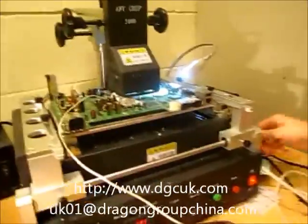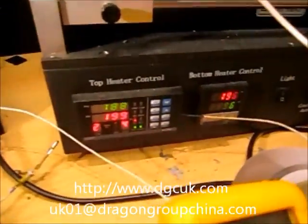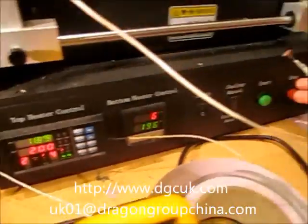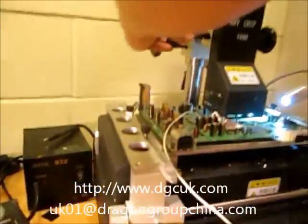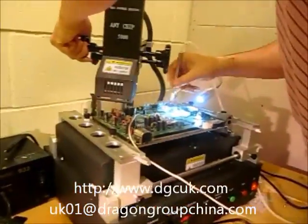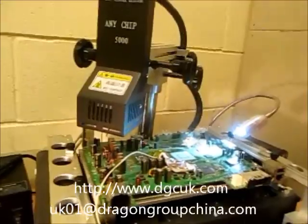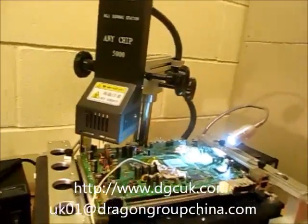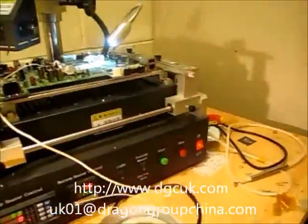The chip on this board is actually lead solder so it's 186 now, so I can actually lift the chip. It should come off. He's fast — 185, that's where it came off.